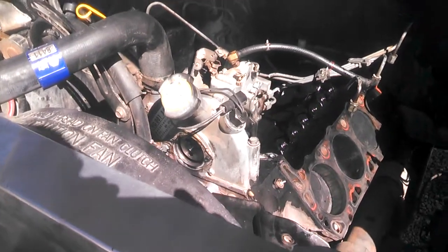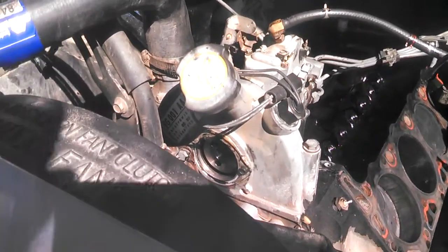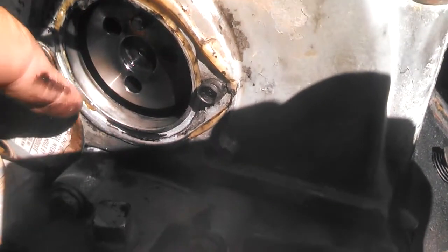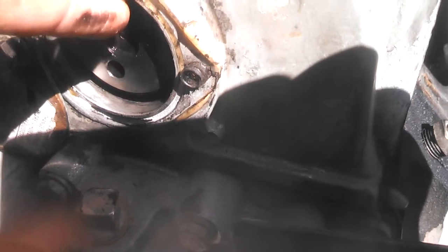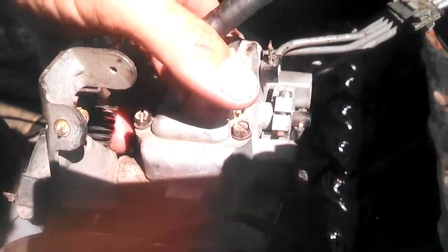What I'm going to try and show here today is how pump timing works. This is the gear here, right here, and that's where the three bolts with the 5/16ths head 12-point nuts or 8 millimeter 12-point nuts go in. The dowel pin that aligns on the crankshaft, and the dowel pin that aligns on the pump. I'm going to show you that this pump is on my dead engine — I'm doing this just because some guys need to see it.